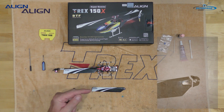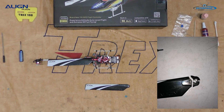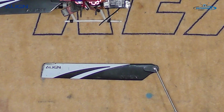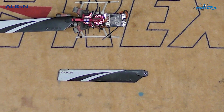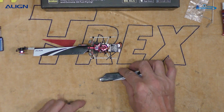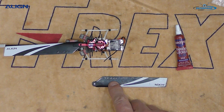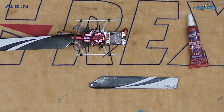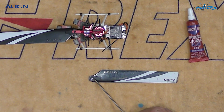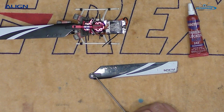As you can see in the picture to the right, there's been a couple of breakages of the blades at the root — right in this location. One of the things that's happening is that people are using Loctite against the plastic. The blades are made of ABS plastic, and if any Loctite ends up in the root section right here, it's going to weaken the blade itself.